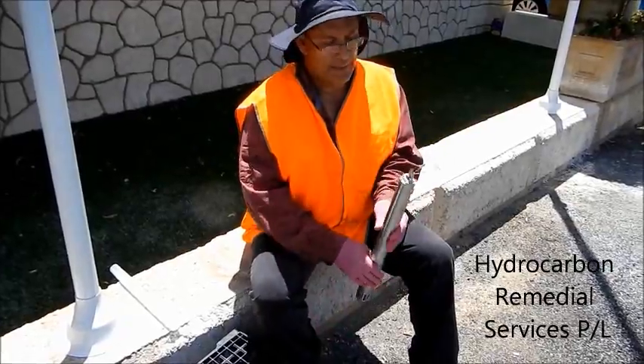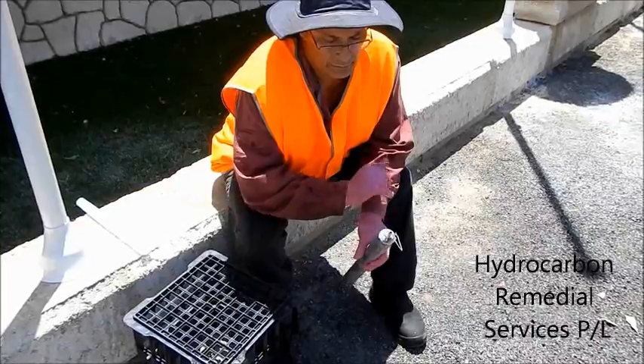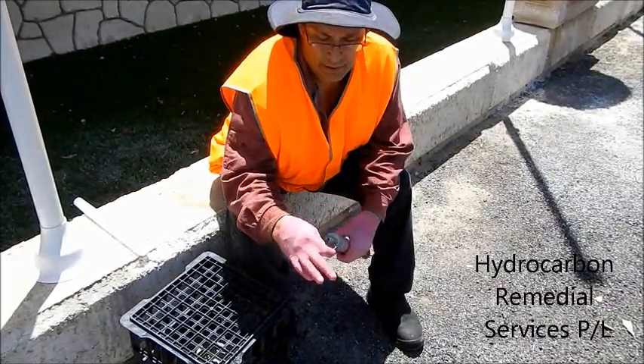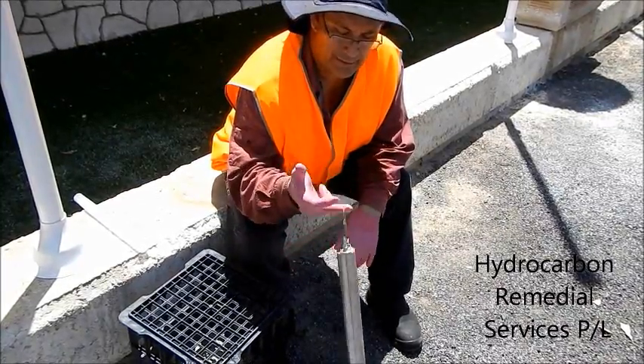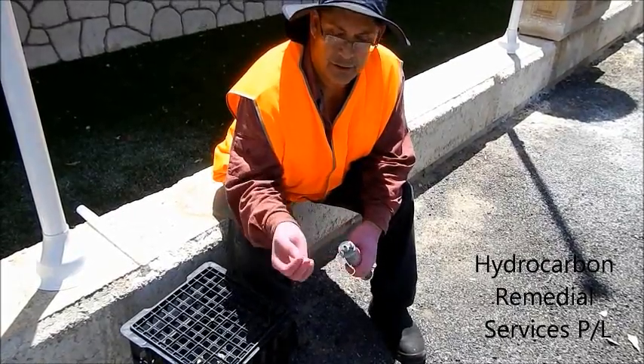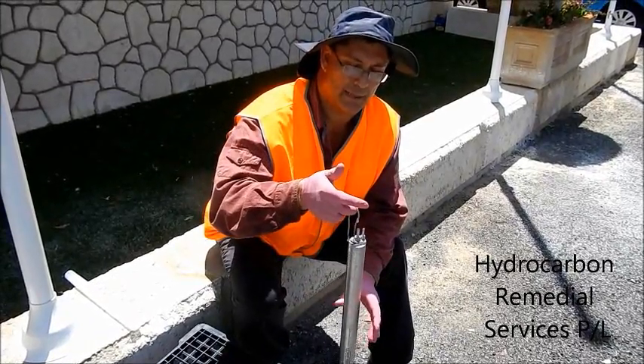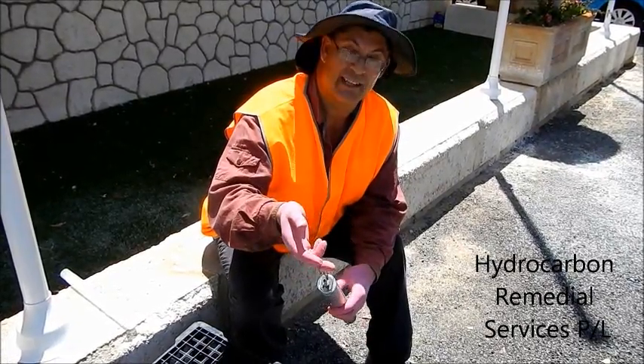When you put that back down in the bore, you'll wash this in your soap solution, then fit your actual tubing on top of that. You'll always, always include your guide wire. So that in case your tubing ever pops off, your wire still allows you to pull all this assembly back up out of the bore. And that's it.